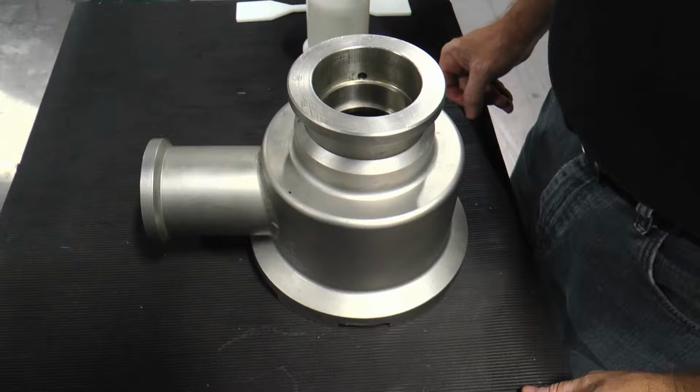Worn-out bearings can cause shaft misalignment that will cause the mechanical seals and gearbox to wear out prematurely. Keep all shaft surfaces smooth and clean, especially in seal and bearing areas.